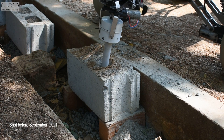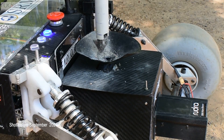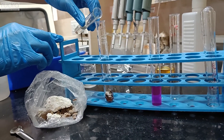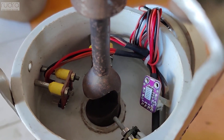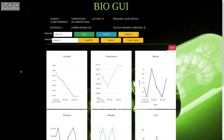The science domain is dedicated to equipping the rover with a science payload consisting of instruments and assays to determine the absence or presence of either extinct or extant life. Sample collection from a minimum of three sites will be done using an auger mechanism and transferred with the help of funnels into respective falcon tubes in a centrifuge setup. The samples are analyzed using catalase and anthrone tests to determine the presence of life. The arm of the auger also consists of multiple gas and physicochemical sensors to detect gases like hydrogen sulfide, carbon dioxide, and ammonia released while drilling the soil, which are major byproducts of metabolic processes indicating microbial activity and habitability.